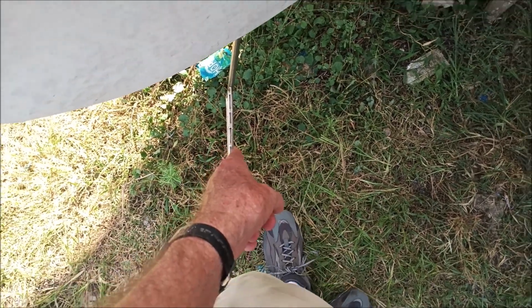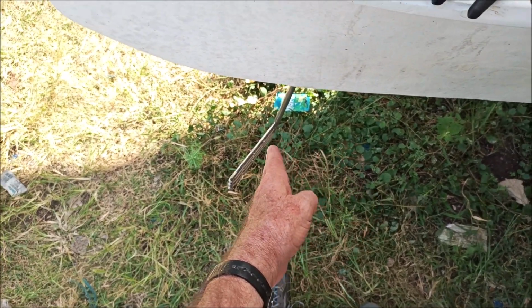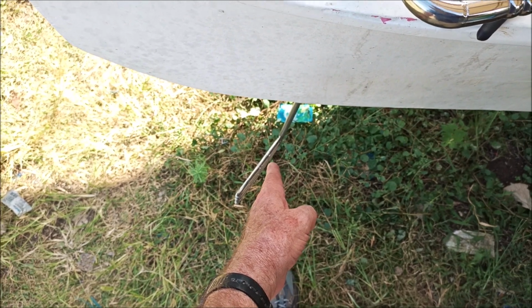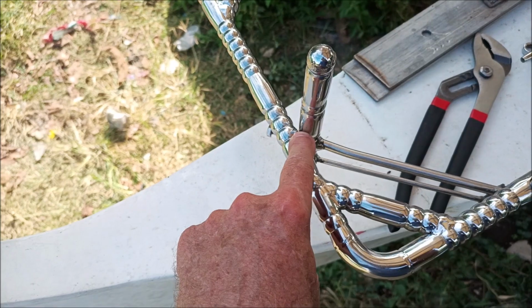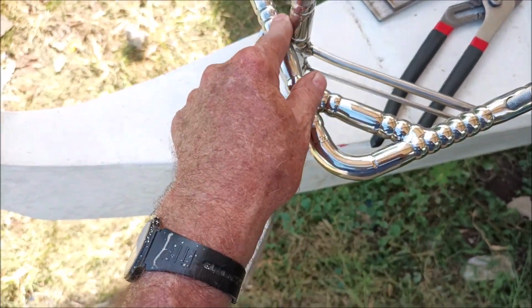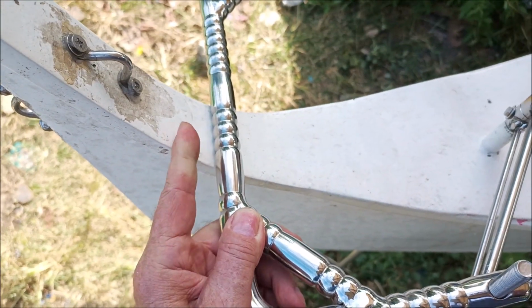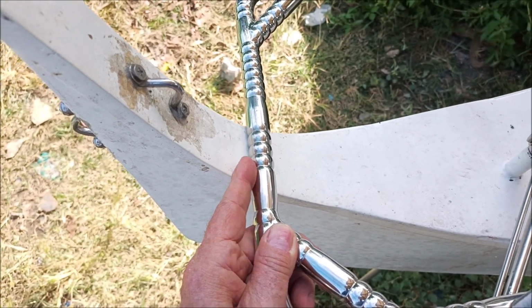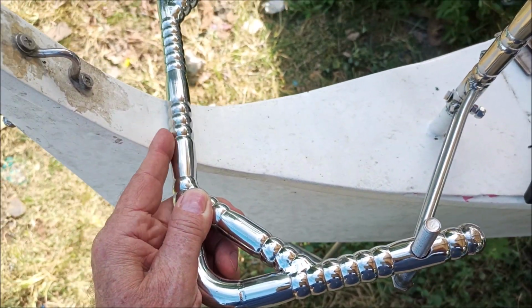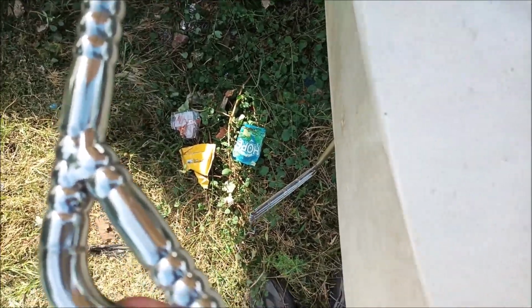Rudders, if you turn them beyond that, they don't really turn. They start dragging and creating like a braking effect instead of a turning effect. So 30 degrees is maximum. So that's why I designed this, the distance and the length and all this, to hit here. Now turn 30 degrees the other way hits here on the back. I'm going to put some kind of a bracket or something here so that it doesn't hit the painted wood. But that's 30 degrees going the other way.